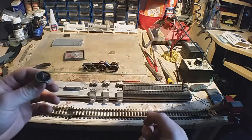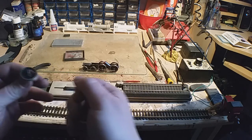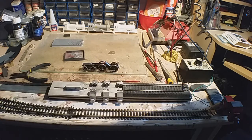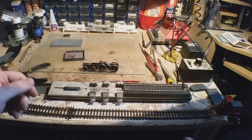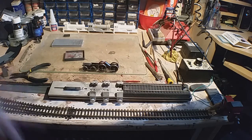When you then pull out the paper washer, the washer itself stops the solder going all the way through, but the thickness of it will give you just that bit of clearance. So, depends what you find easier. That's a bit of a fiddle getting them on and off, but these are better for maintenance because you can easily take things off, replace the bushes, and get to them easier. So I hope that's been informative. I'm now going to hone that.